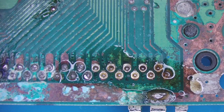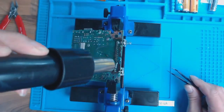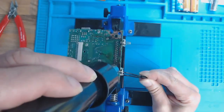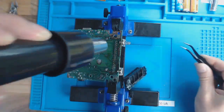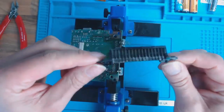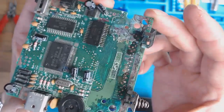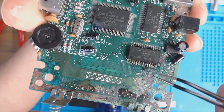I'm really trying to limit the amount of time I have the soldering iron on the board. I've wicked the pins and applied some flux, with my hot air station set at 400. I'm hoping I can get it off without melting the plastic. That looks okay. There's a lot of corrosion just here.